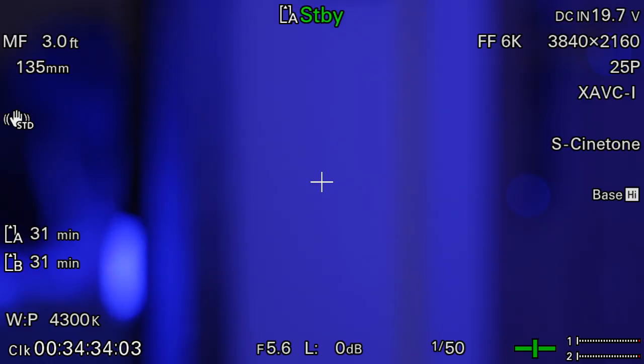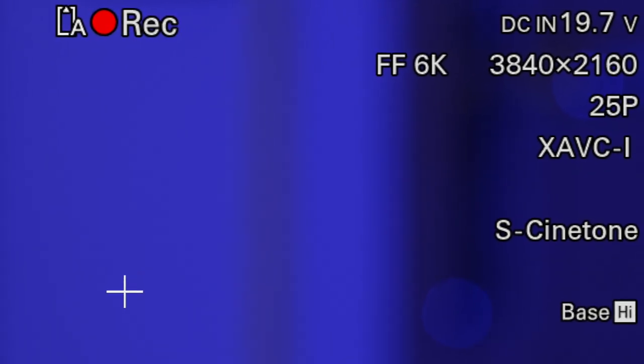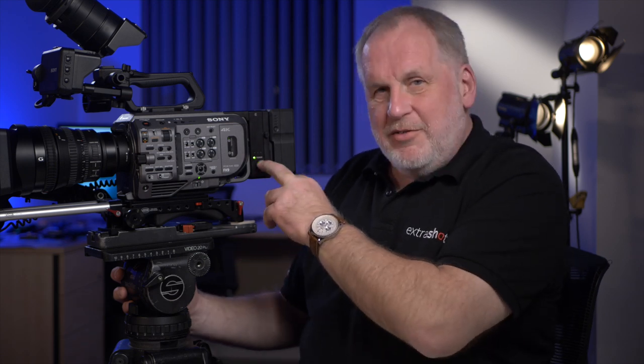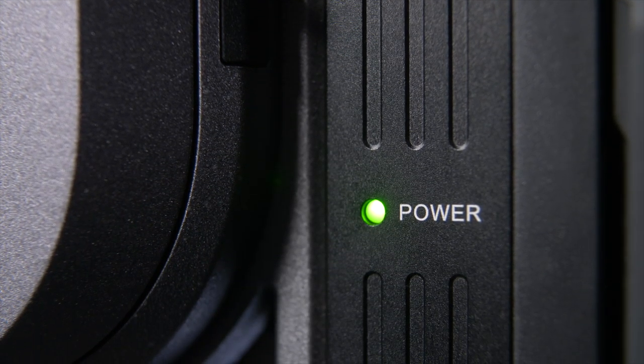All of these adapters for the FX9 need to step up the voltage from the 12 to 14 volts of a camera battery to 19.5 volts for the camera, which means they use a voltage regulator. That also means you won't get a proper indication in your viewfinder of the battery state, because it's always being regulated — your camera will read 19.5 volts right up until the point your battery dies, which could punch a hole in your last file. This adapter does have a very bright LED that flashes red when things are getting close, and it's in a good position so you do notice it. There's also another trick I really suggest everybody uses, and I had to make some rather neat thumb screws to make it work.